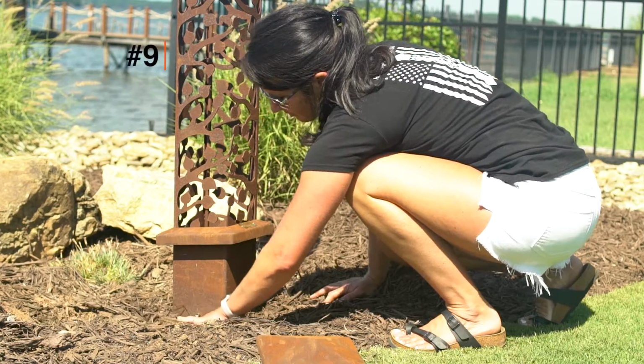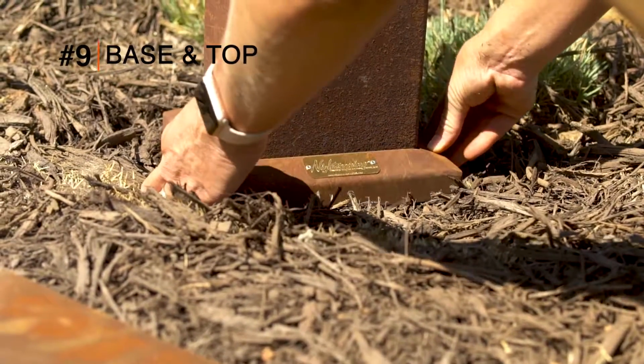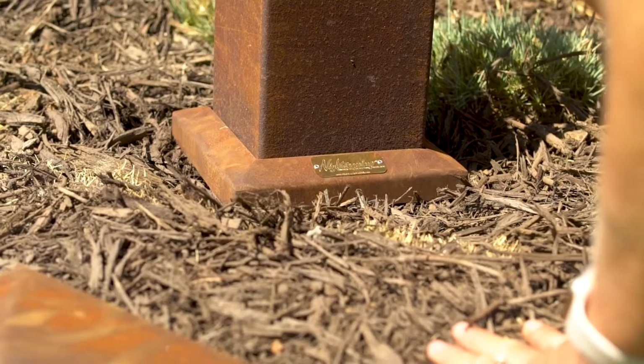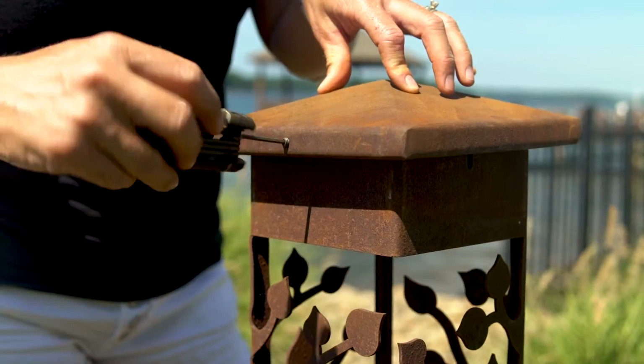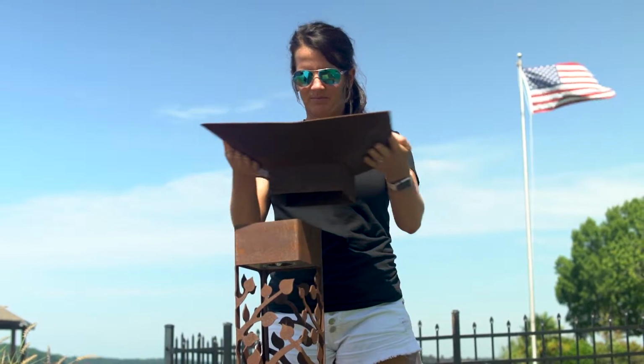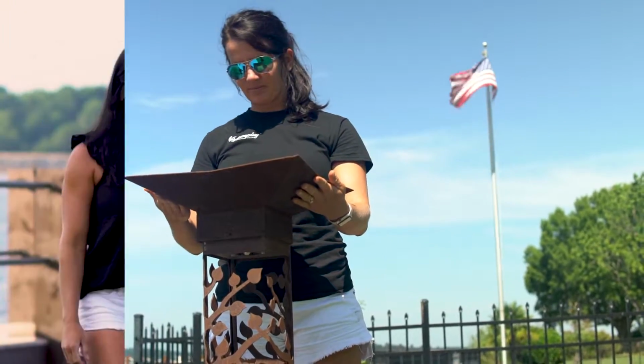In order to avoid direct soil contact with the bollard, be sure to leave a 1/2-inch space between the soil and the bottom of the bollard. Finally, install the top cap to finish your installation. Instead of the standard top cap, you can choose one of Nightscaping's custom toppers.